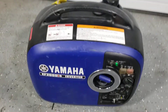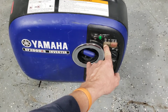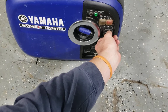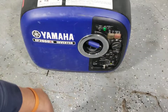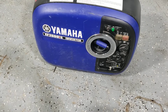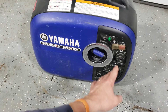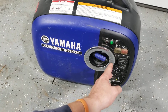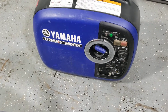To shut the generator off, turn the economy mode back off, shut the fuel off, and close the vent. Typically, if you're not going to use it again for a while, let it run out of fuel. But if you're going to use it again soon, just turn the stop switch to shut it off.